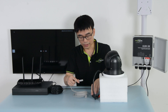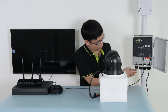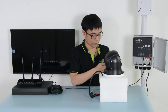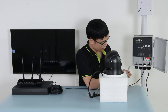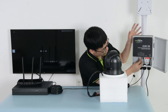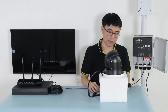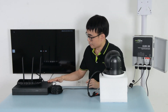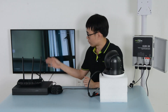Let's connect the cable — one end to the camera, and then to the outdoor PoE switch. First, pass the cable through the gland and the O-ring. Now we can bring the cable into the switch. Find one of the ports to supply both power and data to the camera. Once plugged in, the camera starts moving — it's getting power. This is the network video recorder. The switch has been linked to the recorder, so we can see the live video now.